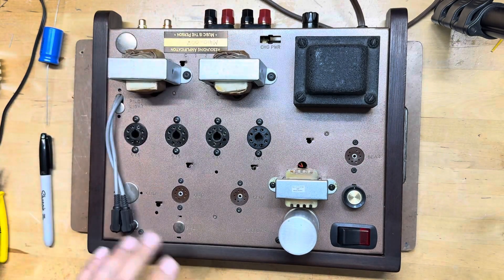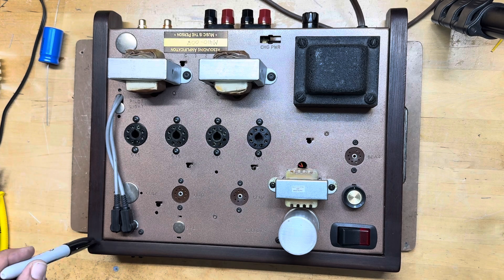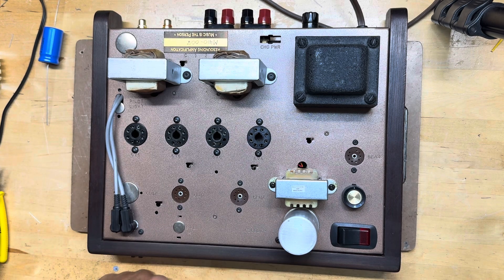The bottom panel is off — there's a little fiberboard bottom panel and four rubber feet. As far as a Magnavox conversion this is really all you could ask for. It just needed a little bit of help — new filter caps — and this is going to work for another 50 or 60 years no problem. I have an 8802 still in the console that's been in my shop for almost a decade, a 9304 in mint condition I haven't touched yet, another 9304 chassis still with the Mullard EL84s that I'm going to do a conversion on soon. A local woodworker is going to build me a nice trim piece and base for it, and I'll have that for sale — maybe in the next three or four months.